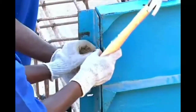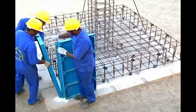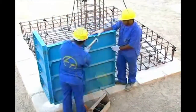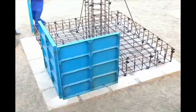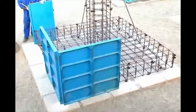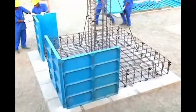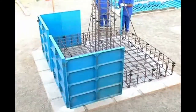While tightening the floor form clips, make sure that the clip should be tightened in the upward direction at the top and downward direction at the bottom. Assemble the floor form corner and floor form at the remaining corners. While assembling, make sure that the floor form corners and floor forms are in line with the marking.